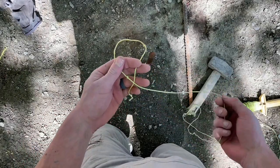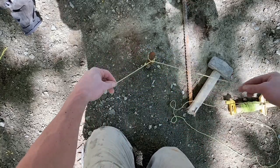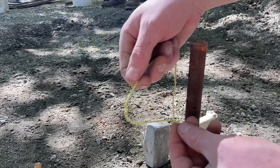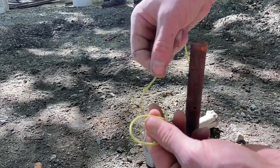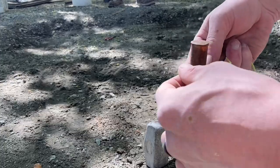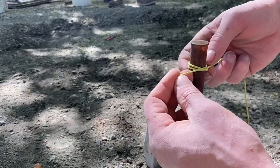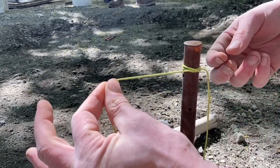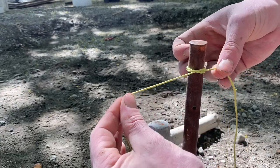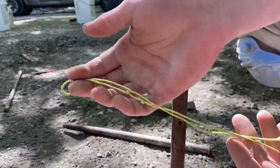The second one is called a clove hitch. Overhand loop one direction and then the same thing beside it — the first one just has to go over top of the second one. The second one slides underneath the first one, and putting that on the stake you can see how it locks on. It overlaps on itself and allows us to pull tension, and you can also release it by tracing that one line into the knot and getting your fingernail underneath it. This technique will get our string lines extremely tight, especially for some longer runs. So let's see it in action here quickly.